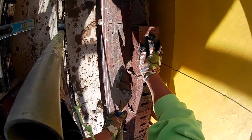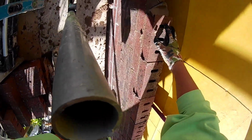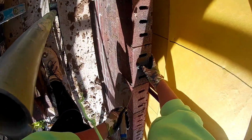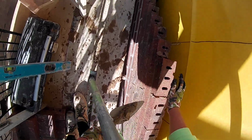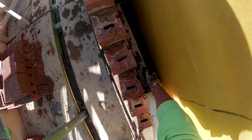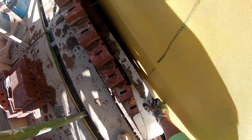There's no corner building involved, and it doesn't put any tension on the actual brick itself. That first brick you lay, you just have to leave your cut off. So you lay your first full brick off the fascia and soffit, and then on your next course, you'll come back and fill in the little piece, whatever that piece is. But yeah,